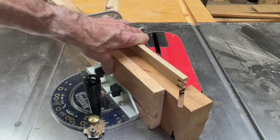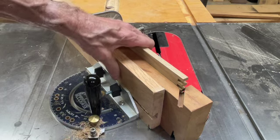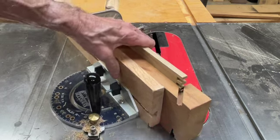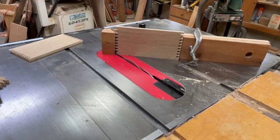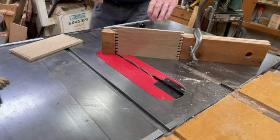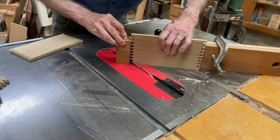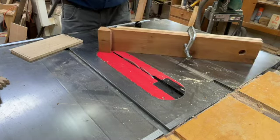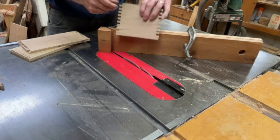I use a fixture I've made, mounted on a miter gauge, to be able to cut the miters. As you start forming your miters, make sure the piece is held slightly away from the stop so that you don't have a piece that gets trapped. You do this in two cuts — first slightly away, then push it in tight for the second cut.